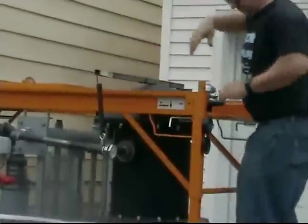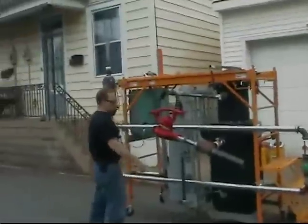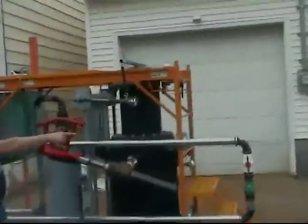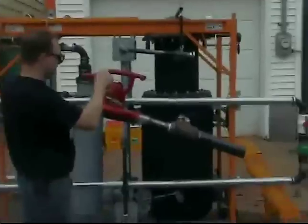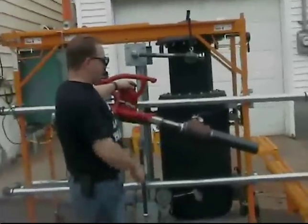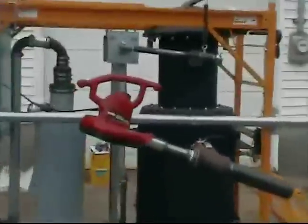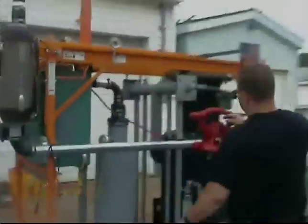First thing we're going to do is fire up this Venturi blower. Okay, so with the check valve in position, I don't even have to close that valve. It won't let air come back through the system and into the gasifier. So if I just fire this up and open that valve, it'll start to pull a vacuum on the system. So come around this side. I'm going to turn this all the way up.